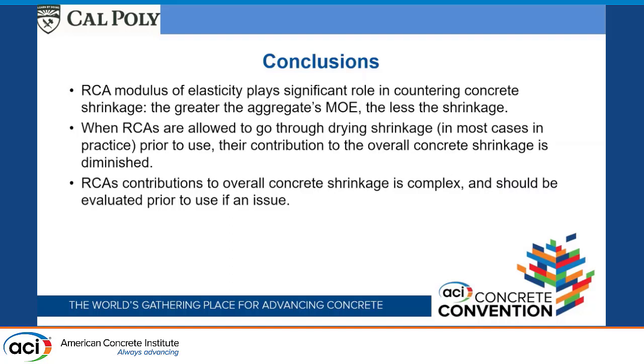Before we mixed the concrete with these aggregates, we did saturate them, or at least they were in a pile with a sprinkler running over them, sort of as standard practice. So they weren't dry when they went in, but that additional moisture can help reduce the amount of shrinkage. There's a couple of mechanisms tied in here, and that's why I'm saying this is still complex. We're just sort of lumping a couple of these mechanisms into this one factor. So, thank you. That was very astute.